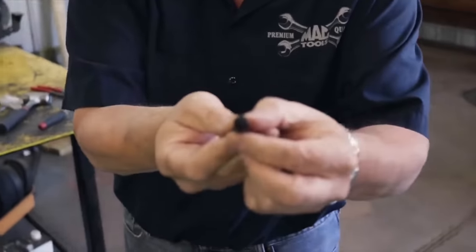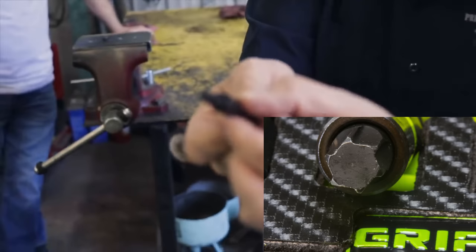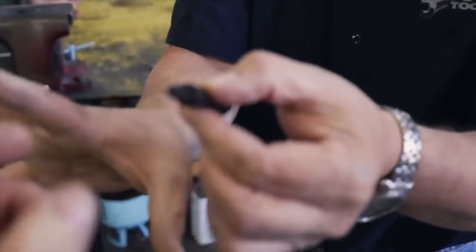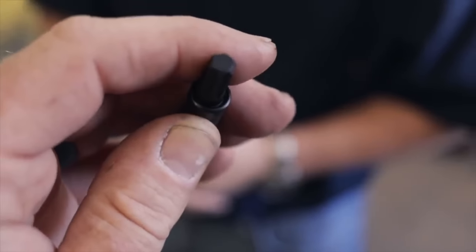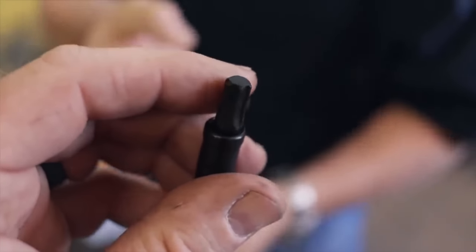One of the other things about a tapered extractor compared to mine: when you bang it in and apply torque, it stretches to the corners, pushing to the outside edges, effectively fighting against the threads, trying to dig it out. With my RBRT extractor, if you look at the head, the teeth are swept to the left, so it pulls the pressure inward rather than pushing to the outside corners — a much more efficient way to extract a threaded piece of metal.